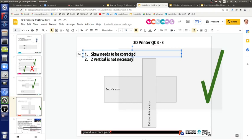So you have to fix like four sensing points that are maybe, how do they do that? I think they have, the bed is not metal, and the way an inductive probe works, it works on metals. So you could probe four points that are the same pieces of metal, which you know their location, and you can calculate.